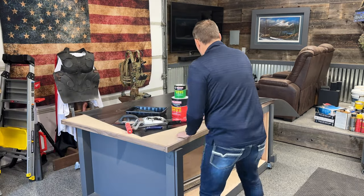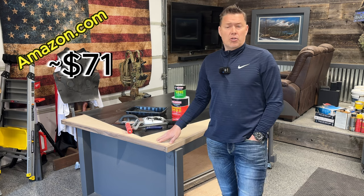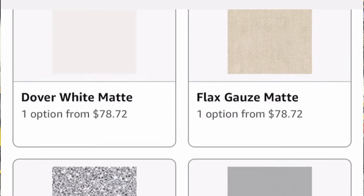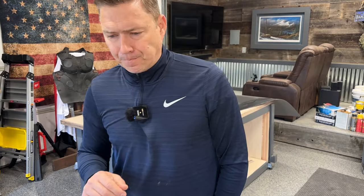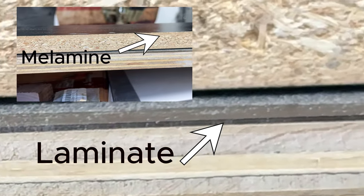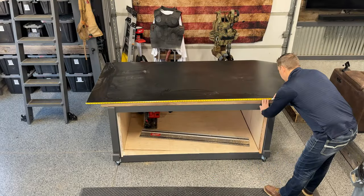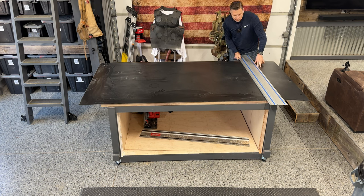This sheet of laminate you can get on Amazon, though I'd encourage you to try to get it locally if at all possible. Another reason to choose laminate is you can get it in almost any color — fake marble color, which is commonly used in kitchens and countertops. I also want to talk about the difference between laminate and melamine. Formica laminate typically ranges between 0.018 to 0.048 inches in thickness depending on the manufacturer, whereas melamine laminate is generally thinner, around 0.01 to 0.03 inches.